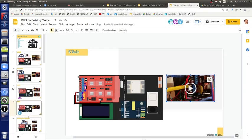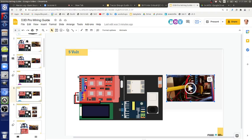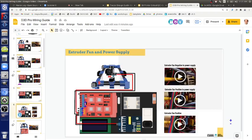Okay, 5 volts. So a little double plug. Those are readily available. They're the thing from the fan. We're saving the fan cutoffs for this purpose. We put the ferrules, the terminals, on them using that crimper and feed that into those two there. So all these terminals have ferrules. That's a way to get a nice clean connection that doesn't fray and break over time. Ferrules are those little cylindrical crimps.